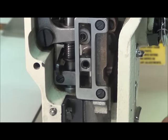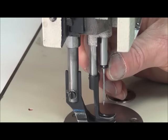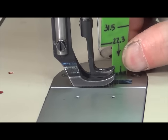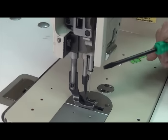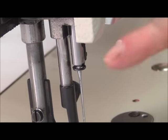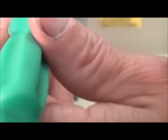Now you can more easily loosen it to just the point where you can move the needle bar up and down. With the needle bar at its highest point of travel, just lift it until it's at the correct height of 22.3 millimeters. Also on the front of the needle bar there's a thread guide groove — you need to make sure when you tighten this down that the thread guide groove is facing directly at you. Once you've got the correct height with the thread guide groove facing you, just gently lock this screw down — it doesn't take much to get tight enough that the needle bar won't move.